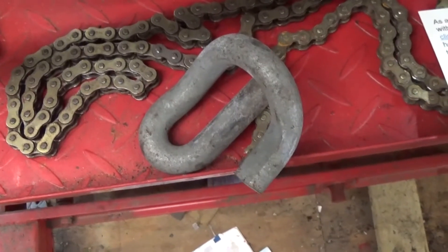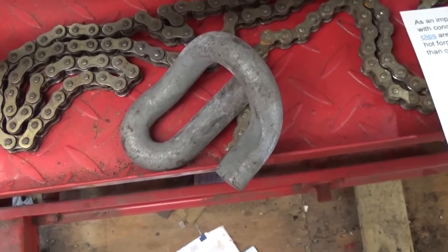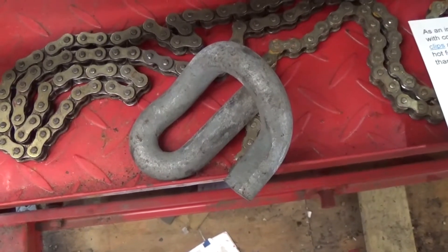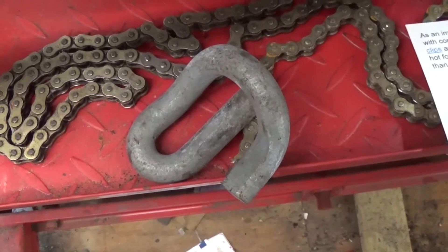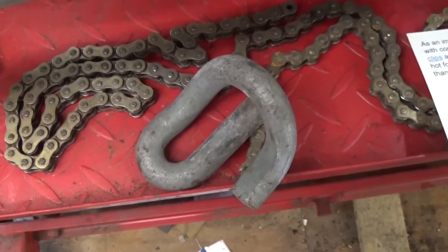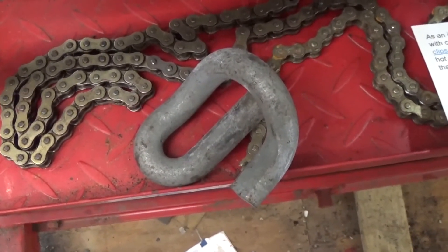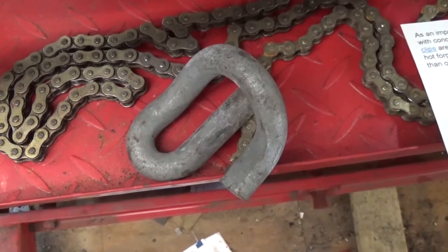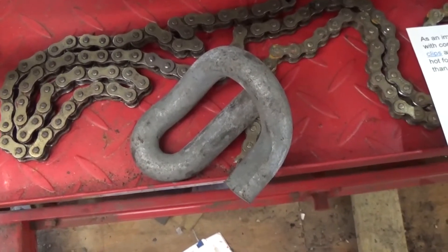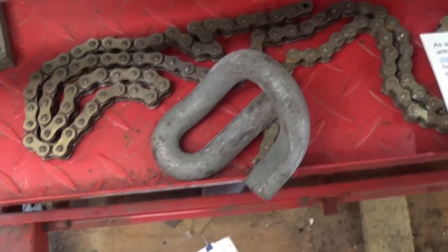It's also used on wooden sleepers. The rail clips are usually made of forged spring steel, manufactured by a hot forging process, which makes these really strong. Of course, they have to be strong to handle tons and tons of weight going over the rails. The forged elastic rail clips are considered better than other metal forming processes due to the most uniform microstructure. So that's what we're going to use.